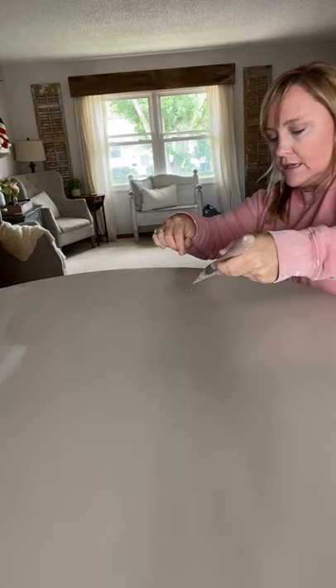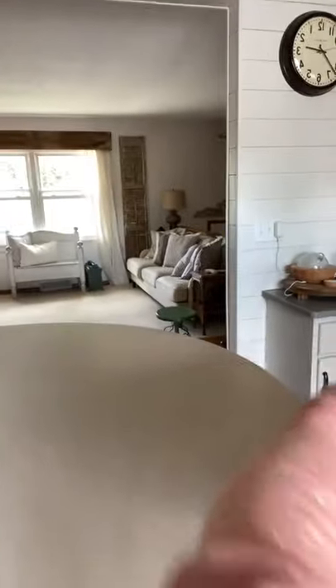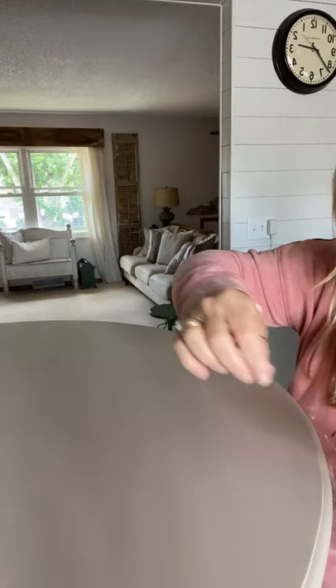Another thing: when you're painting something and it's drying, try not to go over the paint as it's drying because again you're going to be pulling paint off — you'll get chunks and brush strokes. Don't paint over where it's trying to dry. Don't add another coat until it's fully, fully dried.